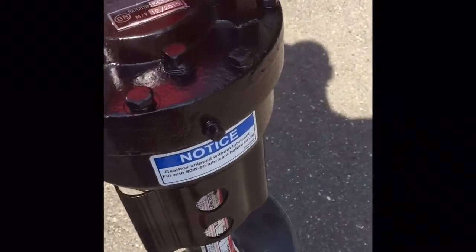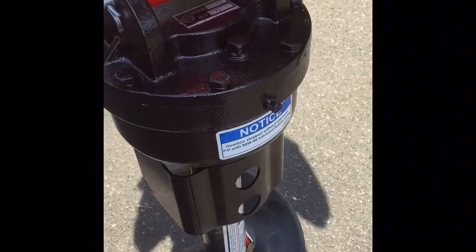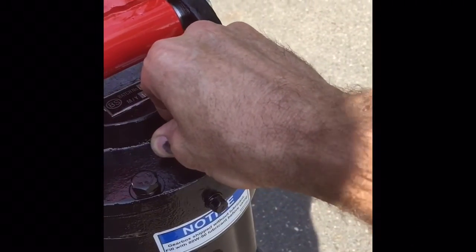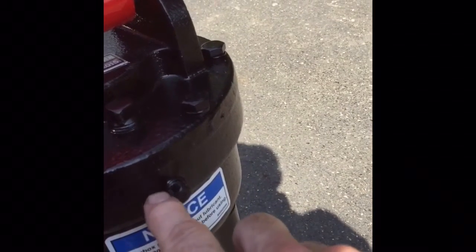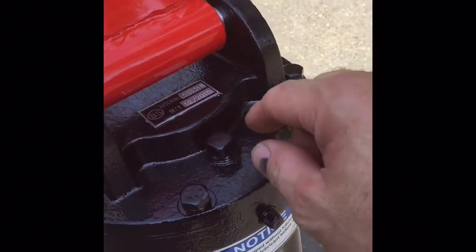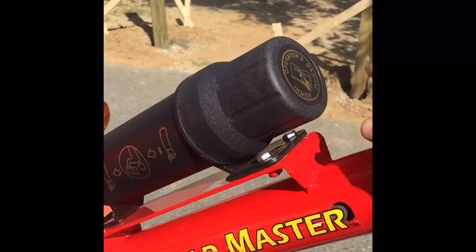The only other thing you'll need to know is this auger comes without gear oil. The manual calls for 90-weight gear oil, which I picked up at Tractor Supply. It goes in here — you simply take this plug off and fill it up to this plug. I tried to remove the fill plug just to confirm it would fill right but it was on there pretty good, so I opted not to. We ended up buying a 32-ounce bottle; they call for 25 ounces, so you can also gauge it by the bottle.